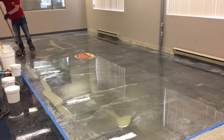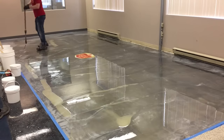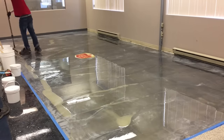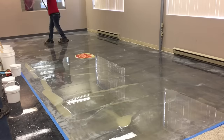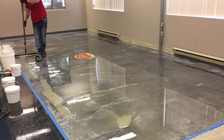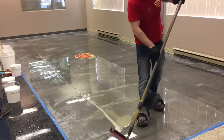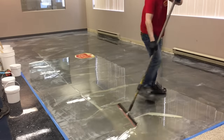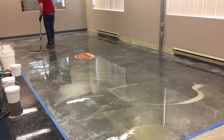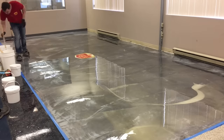Typically when I am doing floors I like to have perforated logos, because it gives you the ability for the epoxy or your sealer to get underneath the logo and stop it from ever lifting. This is just a test area, so that's why that one isn't perforated. If you don't perforate it, you're relying on the glue on the back of that sticker, and if anything heavy hits it, it could pop it. When I see huge logos online that aren't perforated, to me it's a ticking time bomb — it's inevitable before the day comes that they're going to have a mess on their hands.